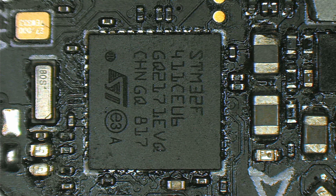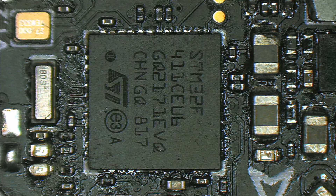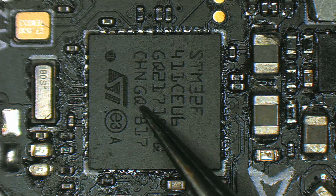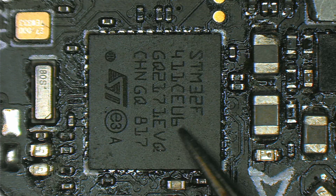I've seen a lot of people burning them and the reasons could be a lot — a little bit of solder in the wrong place could kill one of these boards. The MCU is the culprit; the MCU gets pretty hot when you plug a LiPo in. The switching regulator, which is this one here, emits a buzzing sound and usually that means that the voltage regulator has a very high load.